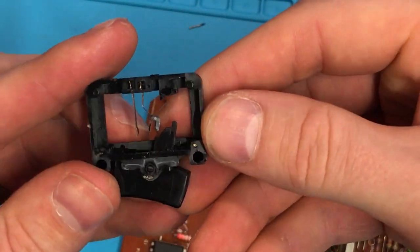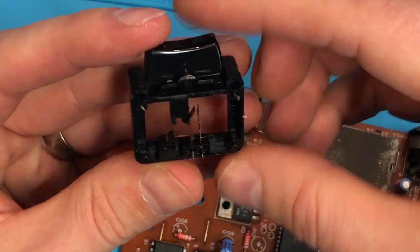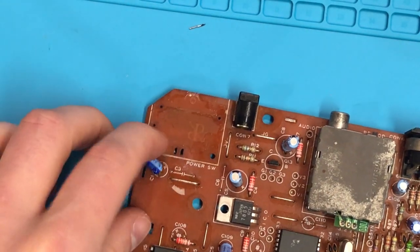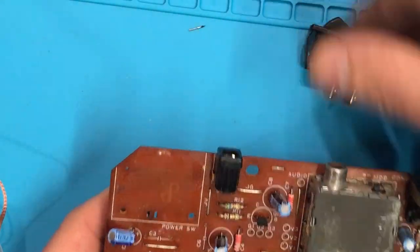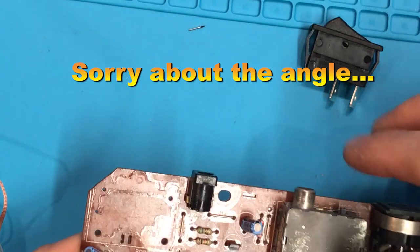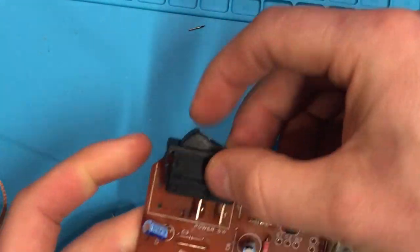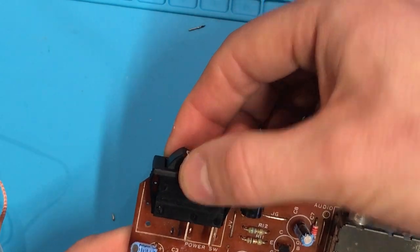So the broken switch is what it is — you could mess about trying to re-engineer and repair the locking mechanism, but I just don't think it's worth it. I don't think replacing the switch really detracts from the value of the console. So there are our power points, which we'll clean up with isopropanol. We're going to run wires down through the board, solder onto that, and then solder onto the switch. The way to physically attach this switch is probably just with super glue straight off the board — there's a nice flat area and I think that would be quite fine.